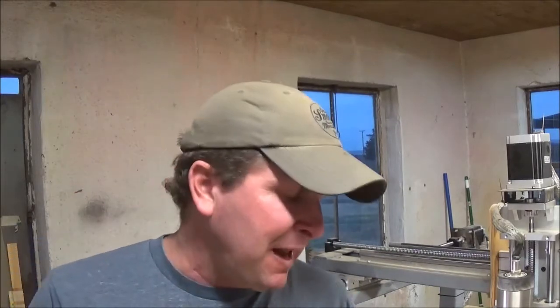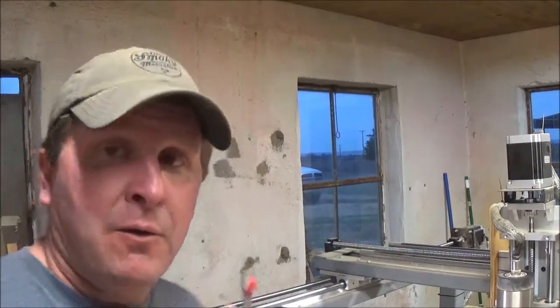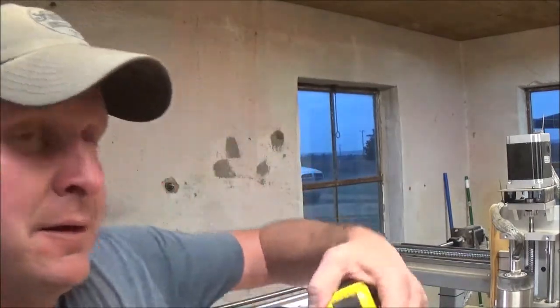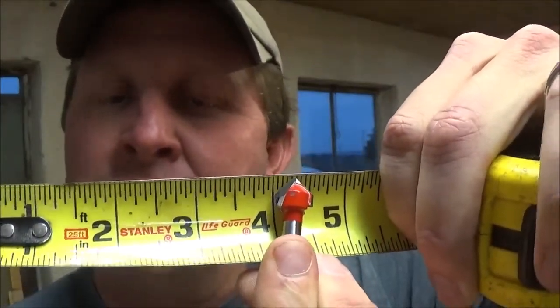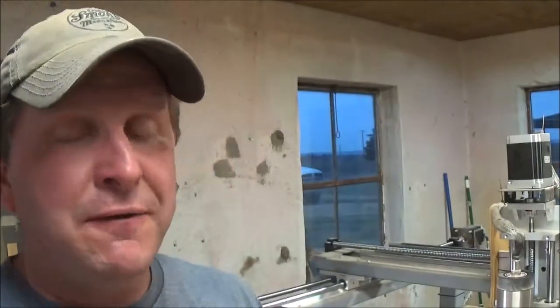That's why I'm not going through just a ton of bits. I go through more end mills than I do V-bits, and I have thrown a couple of V-bits away over the years - but only when I have filed them and filed them to the point that they're getting thin and not quite half an inch anymore. Because when I say a half-inch V-bit, you can hold it up and see that thing is a half inch from one edge to the other. Once you've filed it down and it's coming in at three-eighths, it's time to toss that bit because your detail is going to change.